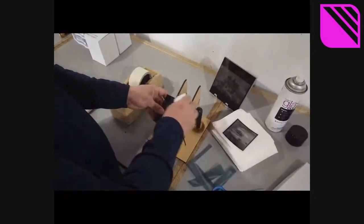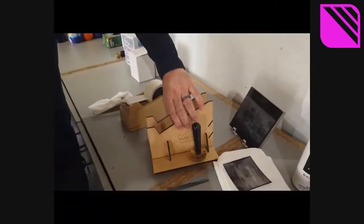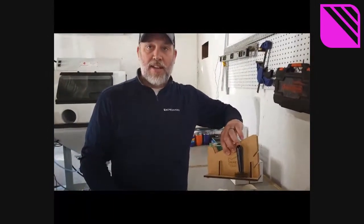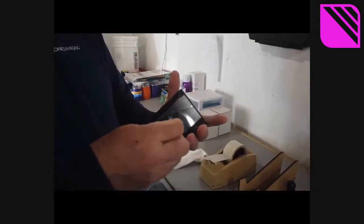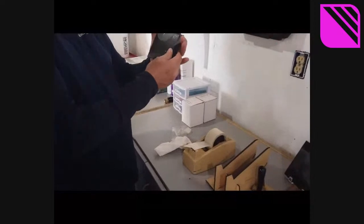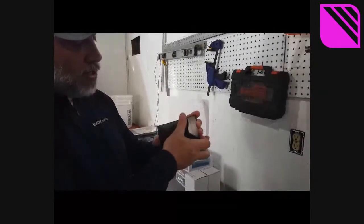You're just trying to push any air bubbles out. We're using the Smart Jig here — that's kind of my pride after 12 years at Iconics; I designed and created the Smart Jig and everyone loves it. Once applied, the final step before blasting is to remove the carrier sheet. You can flick it with your fingernail or use a piece of tape, which is easier. At this point, if there are any little air bubbles you can pop them with your finger.